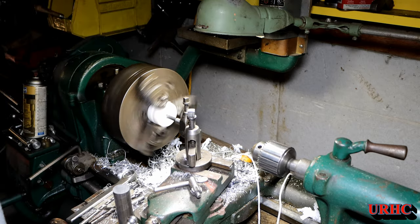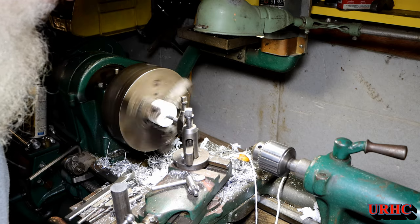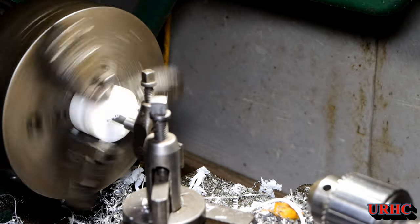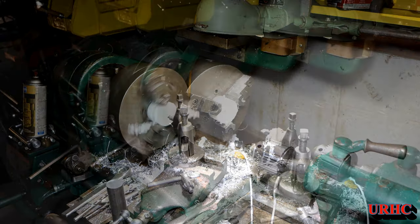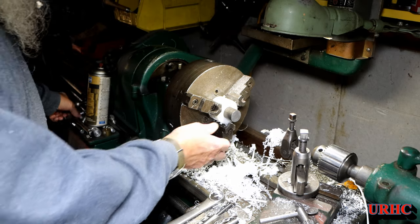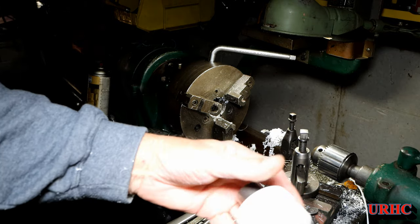That's the inch-and-an-eighth tool steel there. Then the pulley I made — I'm going back to open up the center of it on the South Bend lathe. That lathe is actually older than me by quite a few years and it still runs great. One of the handiest things you can ever have in the shop — if you ever find an old one, they're a really great machine that lasts forever. I bored it out a little bit more, just a little oversized so I'd have some room for paint, and you can see it's a perfect fit.